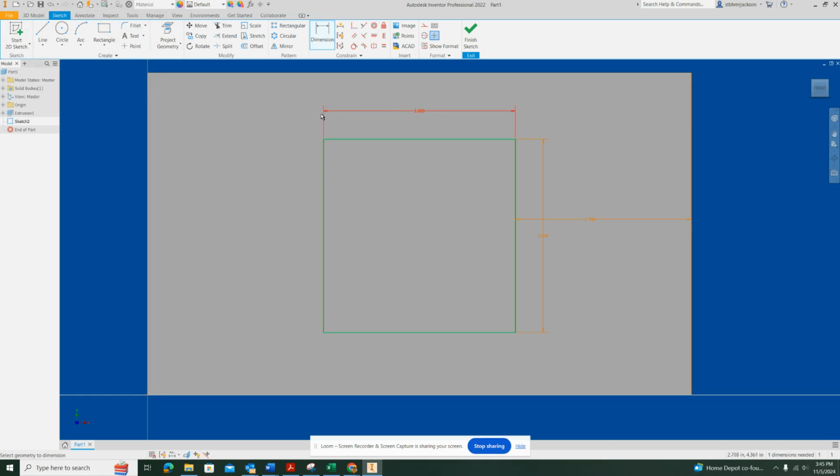All right, so we need to center it vertically as well. So it is 5 inches tall. This square is 3. So that leaves 2. So it's an inch. Center it this way. And by us putting that one there, it's being 3 inches around. We're having our 2.75 here. And we can quickly do a little math on that just to make sure that we are correct. So we're going to do the 8.50 minus 3. So that's 5.50 divided by 2, which is 2.75. So I think our math is mathing.